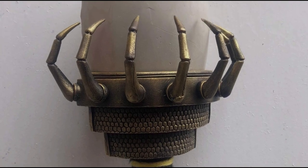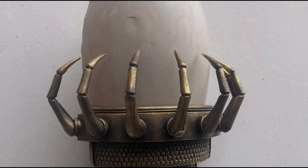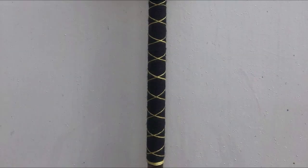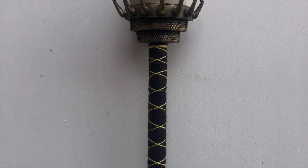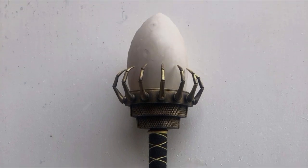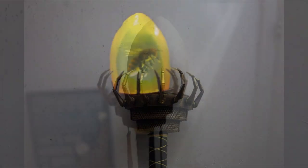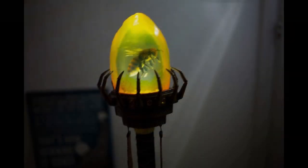Then we repeated the previous steps of making a silicone mould, so we could easily reproduce the base. The LED lights were installed into the base and extra detail was added before painting. When we were happy with the fit and our amber casting had more work done to polish the surface, we glued our casting in place using some standard epoxy laminating resin.